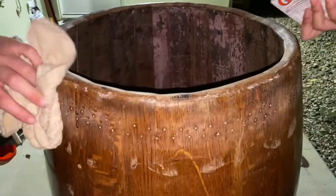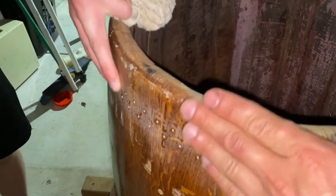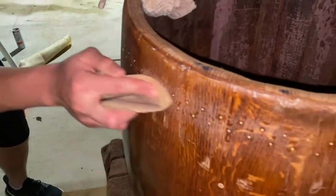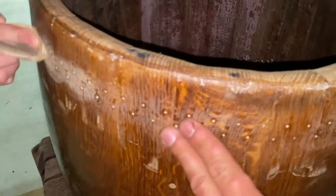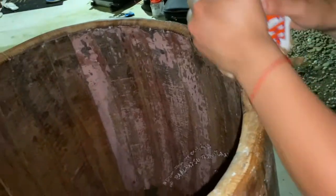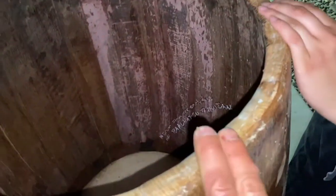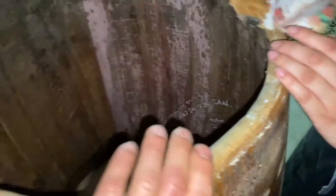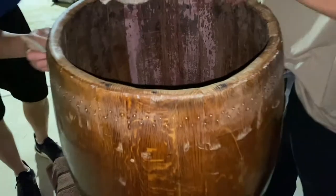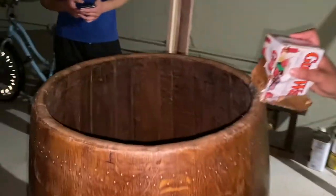We're finishing up the end of the barrel. Tommy is going over the recently filled-in toothpick holes, making sure they're super smooth — because we're going to be pulling the hide down over this surface, and any irregularities or friction will make it harder to get a nice even pull. We're lightly sanding these down. Meanwhile, Manny is applying golf wax — a solid wax — to the rim so it's nice and smooth as the hide is pulled down over it.